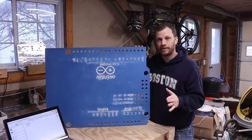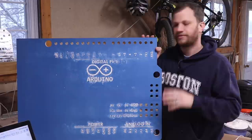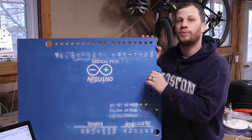But after thinking about it for a little bit, all I need to do is fix that lettering, and I think I've come up with a clever solution for that. I've regenerated these tool paths to cut those letters much deeper. If I threw the workpiece right back onto the CNC, I could probably get the alignment close, but it definitely wouldn't be exact. So in order to make sure everything lines up, I'm going to establish a new origin for this toolpath.